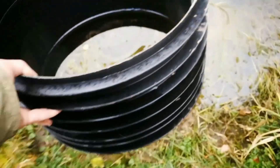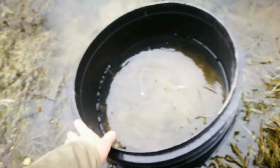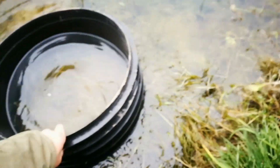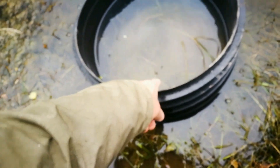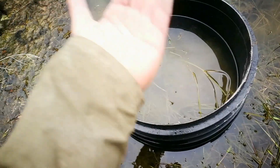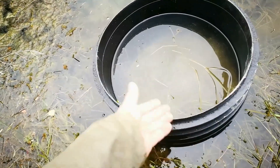Because I've got a naturally lined pond in this clay, I can use these offcuts of pipe — drive them in, drive them into the clay base. Once they're driven in, they'll become waterproof inside. I can pump them out to get the water out and then fill them up.